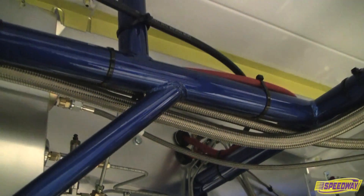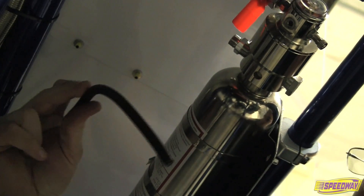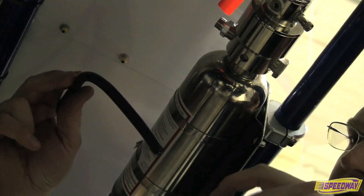The cylinder is now ready for nozzle and detection tube installation. Locate the composite discharge tubing — this is used as the nozzle line, which is connected to the cylinder by the compression fitting. The tubing has been designed to hold its position when bent in a particular direction.